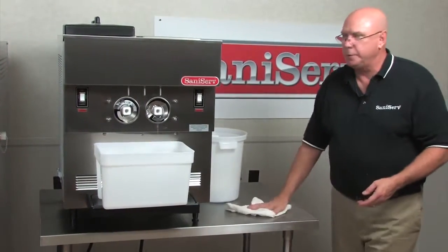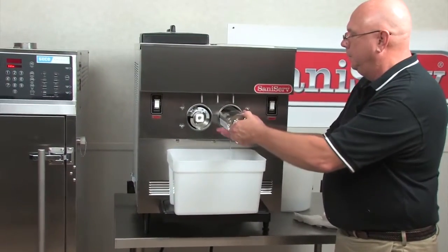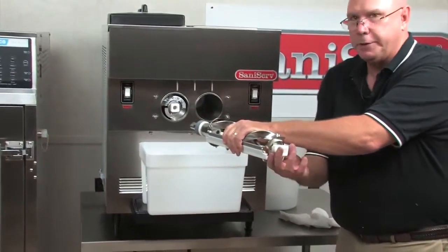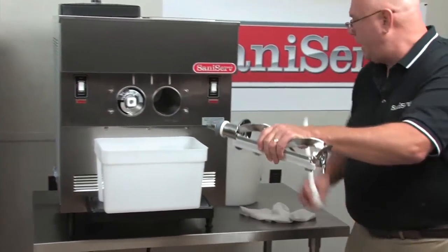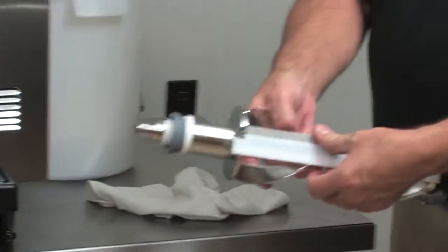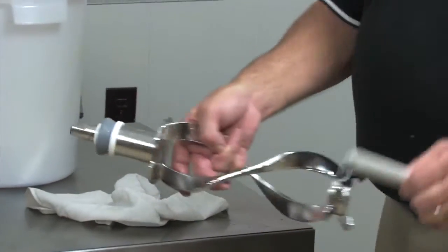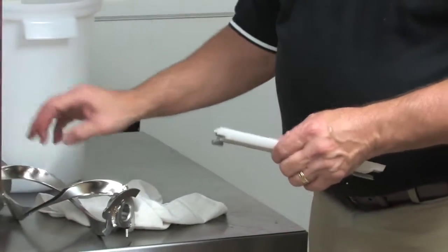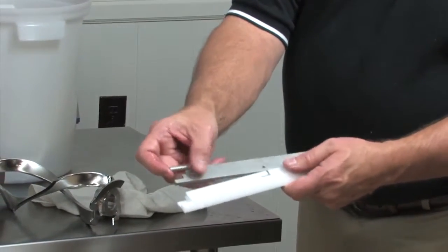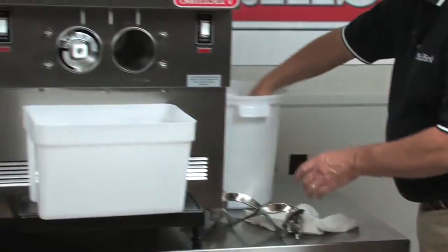Next we have the dashers. Going to grab onto one of them and pull it out. I'm going to get the stator rod out of the assembly. I'm going to lift up, push forward, and get the blade holder out. Then I'm going to get this off of the pin by moving it along the dog leg to get this apart.